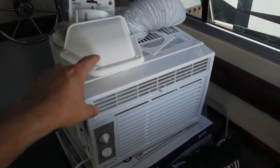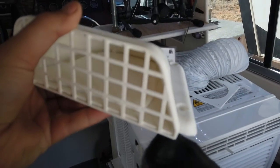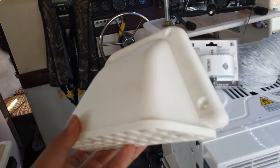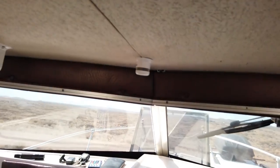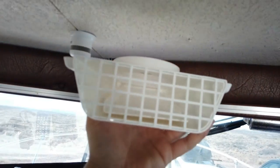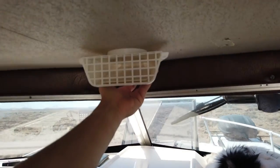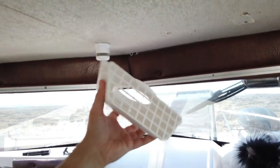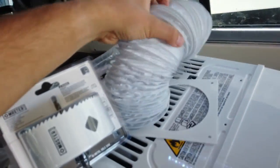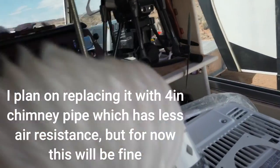The next component is the vent. This is actually the same vent you'd find mounted on top of a house, and I figured if it's good enough for a house it should be good enough for the boat. This vent is probably going to take the spot of my fire alarm up here on the roof. So the air conditioner itself is going to go up on the roof, attached to that vent with some simple flexible air duct — this plastic serrated stuff.